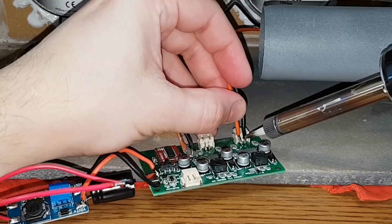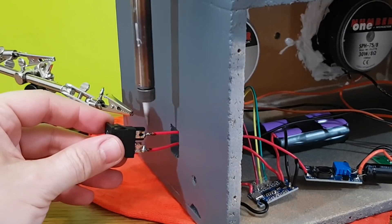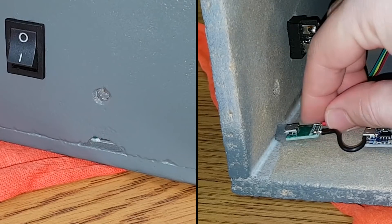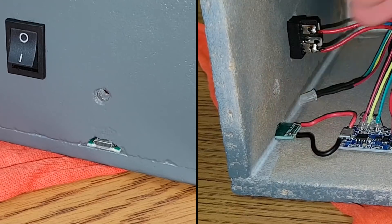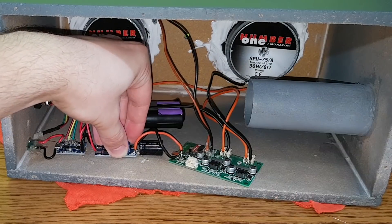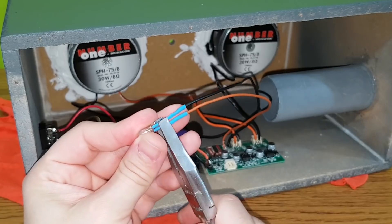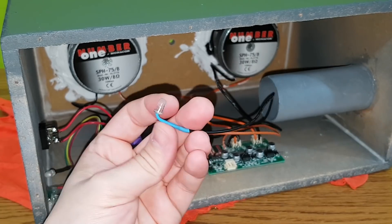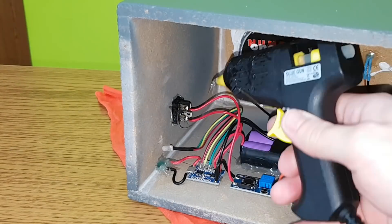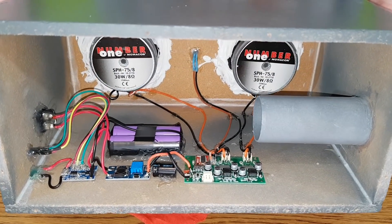Be careful when soldering the speaker wires — if you reverse the polarity of one speaker, the sound quality will be very poor. The switch must be soldered from outside the box. For the USB charger, I'll use a micro USB breakout. The next step is to fix all the components to the MDF with hot glue. The Bluetooth LED pins will be bent to 90 degrees so the wires will be directed down. I'll also use hot glue to seal the switch. All the components are fixed in position now, with some wires glued to the MDF panels.